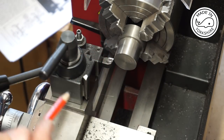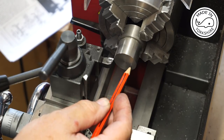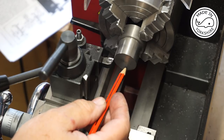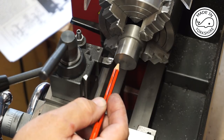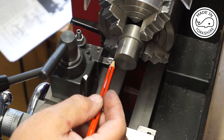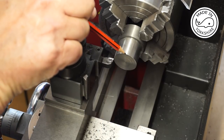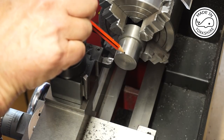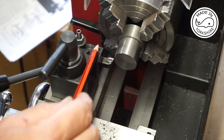I think I know what I'm doing here. I need to create a flange which is going to be five eighths of an inch in diameter and that will just slot inside the cylinder. I worked that out to be a quarter of an inch in. I'm going to use this facing tool to make the cut a quarter of an inch in and it's going to be cutting lengthwise one thirty-second of an inch, which is about 30 thou. I'll cut in 10 thou increments on the compound slide.